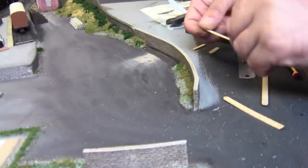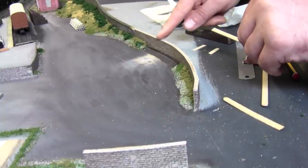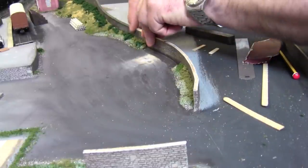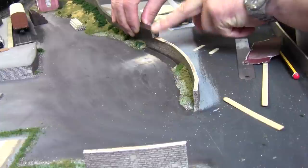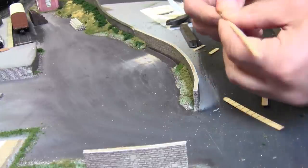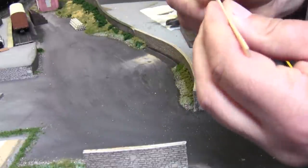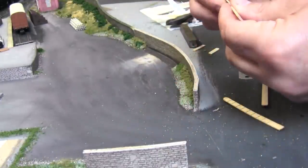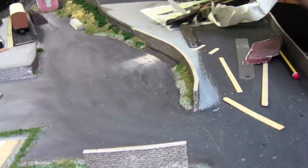It's not a very straight wall so I'm going to have to cut these down every so often to follow the bend. As you can see, from there to there we've got a nice straight bit, so that'd be ideal for that bit there. We just PVA wood glue them on and put a weight on to keep them there while the glue's going off. If the coffee stirring sticks are slightly bent, just straighten them out - it's probably better to have the bend on the inside so when you put the weight on it'll flatten it nicely.